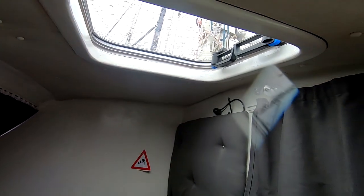because it started to let water in. So what I did last night was go around with a bit of sealant, just a bit of white sealant I had lying around, 291 maybe, and just squirted a little bit around where the hatch meets the wood, and that stopped it. Raining last night, raining today, and we've got a dry bed. What I also did, where the wood meets the coach roof, I put a nice big bead of epoxy around there, because there was a crack there as well where the heat had moved everything around. But all's well that ends well. I've now got a dry bed and a double, triple sealed hatch.